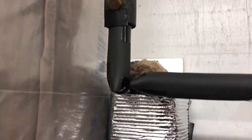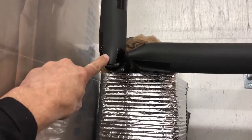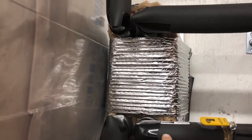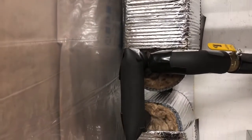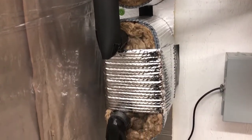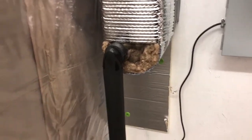Our hot water is coming on down and we have a 60-plate exchanger — boiler water through the exchanger. This plate exchanger allows isolation of the loop that's going to go over and heat the house. I have a second 60-plate exchanger next in series that has nothing connected to it; that's for future expansion or other use.